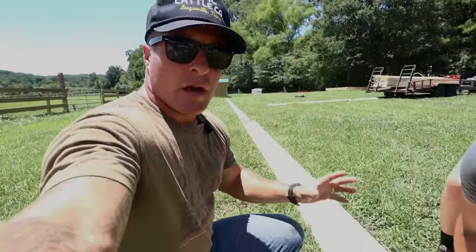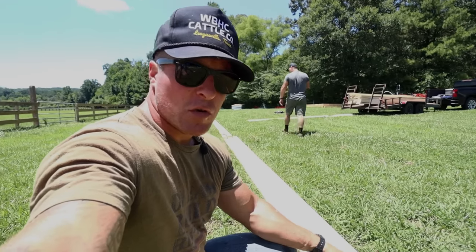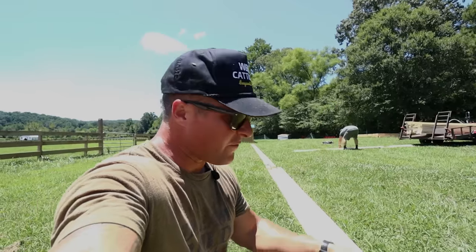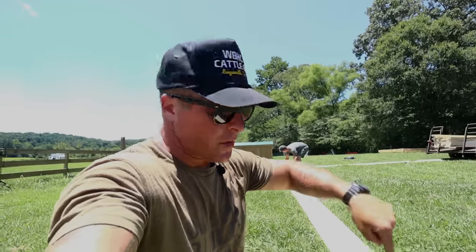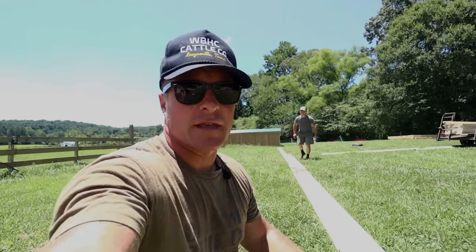So I'm gonna lay out all these 2x4s, the length of the building, and I have the measurements of exactly where the engineered trusses are gonna sit. I'm gonna transfer those measurements to the 2x4s, the full length, and then that way these will be four of our purlins for the top. So we'll start standing these triangle trusses up, lay these purlins right up top. The marks on our purlins will tell us exactly where the truss goes, and we'll start frame nailing those together.